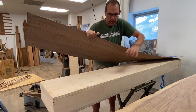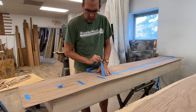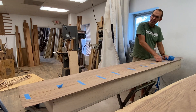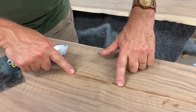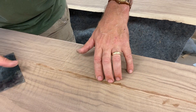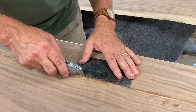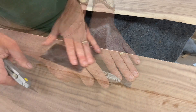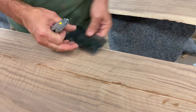I flipped the mantle over — this is the second side — and this is the piece of veneer that I glued up that's going to go on this side. I just need to untape it, get the contact cement on it, and do it just like the other side. I've got one spot, just this little spot right here, where the veneers aren't lined up. When I glued them up I missed a spot. The glue's set up now and it's really hard so you can't just push it down. So I'm just going to re-split it with a knife, push it down, put it together — still looks pretty good.